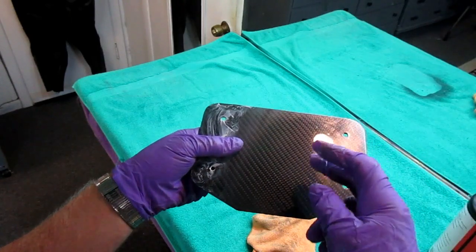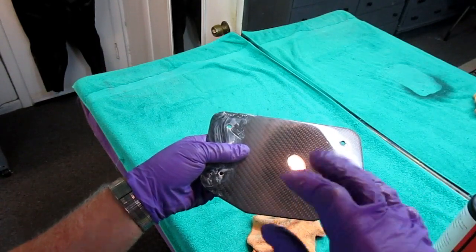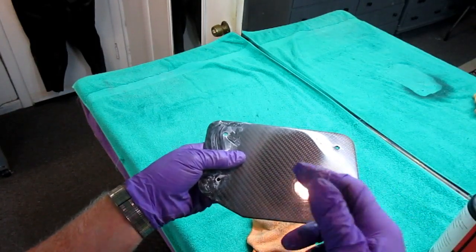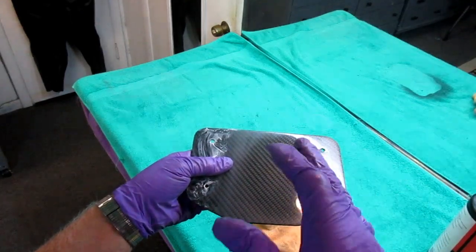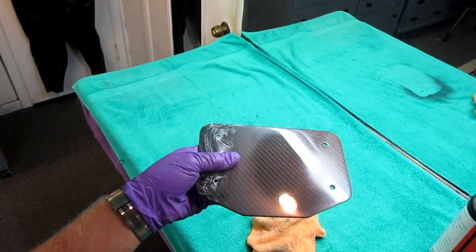Now, the only thing I would caution anybody about, if you're using a buffer on anything, powder coating is very soft. It tends to just disappear with compound. Paint, you can always put more paint on. In this case, we have a lot of clear on here, so we can buff this over and over and over. If we had powder coated this, I'm still skeptical about those powder coated wheels, that someday I'm going to go through and then I'll have to paint them.